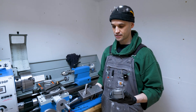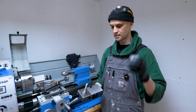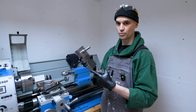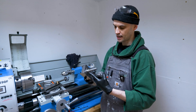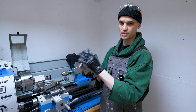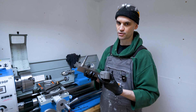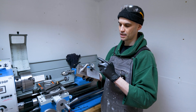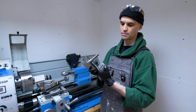The issue I've got is that the Peewee Tools inner shoulder here is 26mm. The stud that comes with the BL290F lathe is 24mm, so you can see it does not obviously register on this shoulder here. What I'm going to do is temporarily make a sleeve that will basically expand this to 26mm.